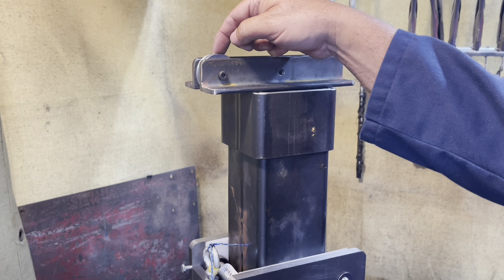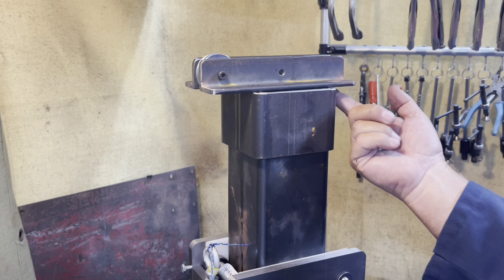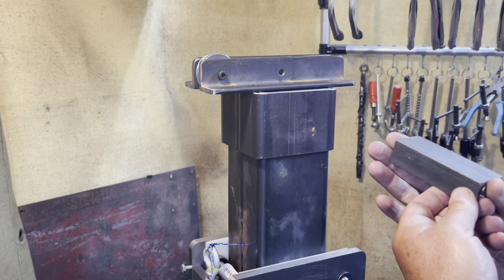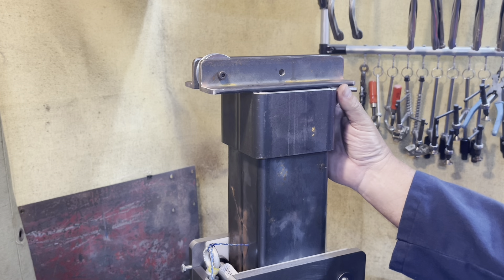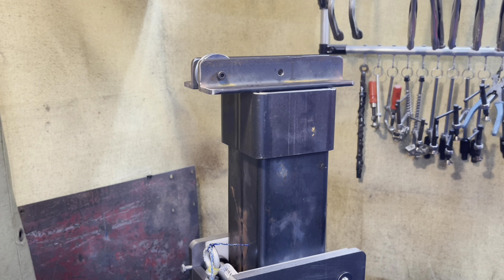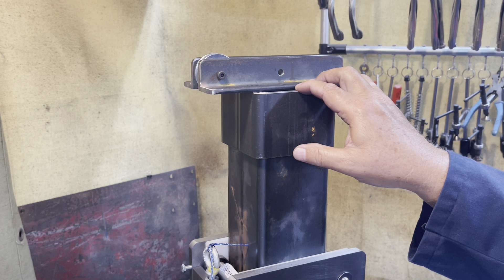All the weight is going to be on this pulley and it's going to push this piece. If I weld it here, that's not a lot of surface area. By adding this piece of angle iron back here, I have a lot more surface area to weld to — and that should stop it from flexing. Let me get everything ready for welding and we'll start making some sparks.